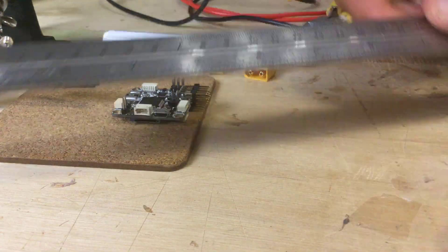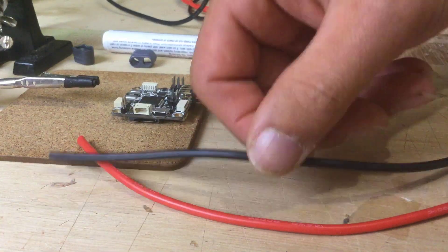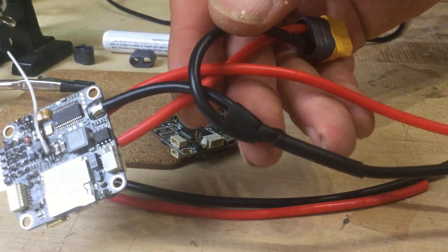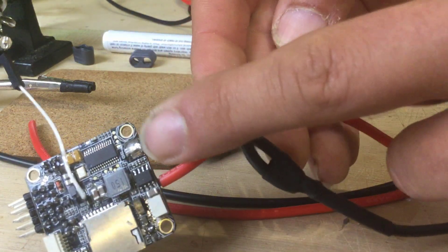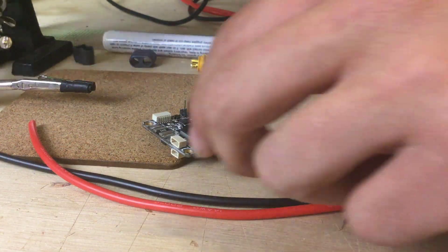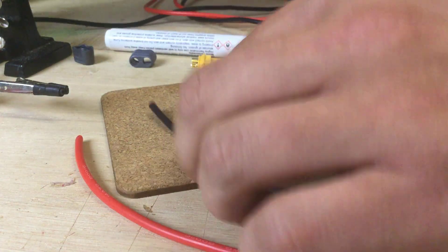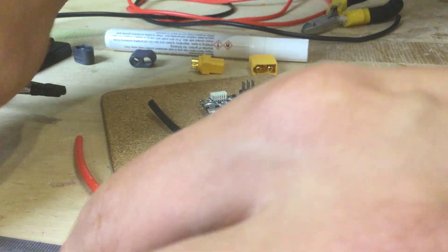Just duplicating the red wire. So I've got a red wire, 14 AWG cable, and a black one, both about eight inches long. So they'll both go up around onto the board. Now the thing which I like to do is actually cheat — I make this little Y connector. So then we can take the ground wire around to our ESC. We have a full ground wire going across to the bottom of the board, and then we've got a full size cable which goes around to the ESC connector. I'm going to go about two inches at the cable, and the other piece of cable which I'm going to chop off is about three and a half inches long.